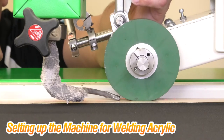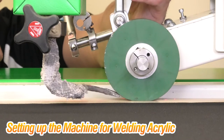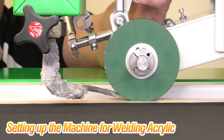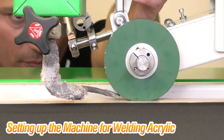That is a bad position for the nozzle. Secondly, if the nozzle is set too high — almost touching the weld roller — the nozzle will swing in and break our tape. It will heat the tape too much and break it, or it will actually hit the tape and snap it right off at the beginning. The correct nozzle position is about an eighth of an inch off the weld track, squared up from side to side, and about a quarter of an inch back from the pinch point.